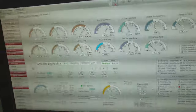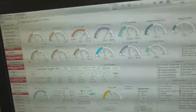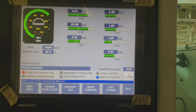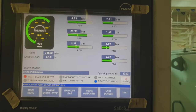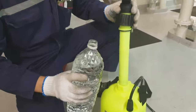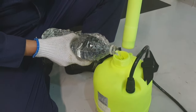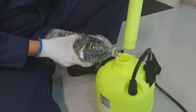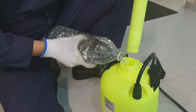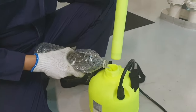The criteria for washing at the compressor side of the turbocharger is that first we have to run the engine as close to full load as possible, and the cleaning process is only to be carried out when the engine is at operating temperature. As you can see, our engine load is 67 to 70 percent at about 770 to 800 kilowatt.